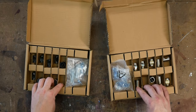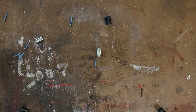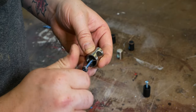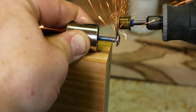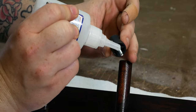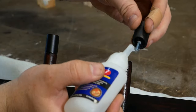While the finish is drying, I prep the metal cap knobs. The ones I use came in several different colors and come with their own screws — there's a link to them in the description. I locked in the threads with superglue before cutting off the screw heads with a Dremel — you could also do this with a hacksaw. I then glued the metal caps to their dowels using thick CA glue and painter's tape to hold them in place.